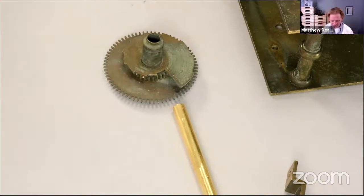So, right, concentrate, Reed. Going to prepare everything for soldering. Then I'm going to put the dial on, make a hand, check it tracks parallel, then carefully take it apart, hopefully heat it up, hopefully it won't all fall apart. But even if it does fall apart or it does move when we solder it, the beauty of soft solder, of course, is we've got a bit of a chance to go back and rearrange things a little bit by heating it again.